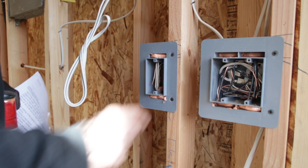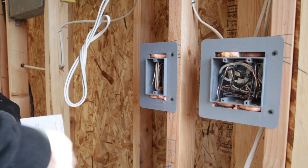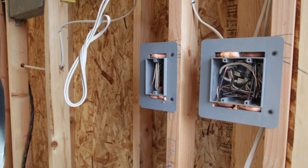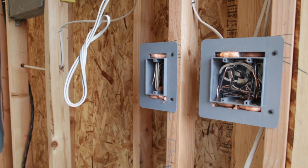Where they run their wires through, there's a little chamber in the back that we fill with spray foam. That keeps any air from leaking into the box, so we use these on the exterior walls and ceilings for light fixtures.